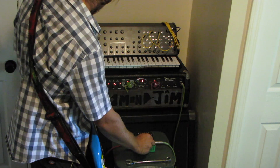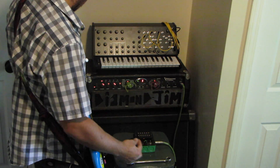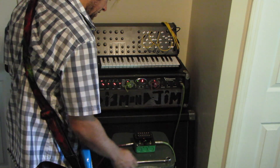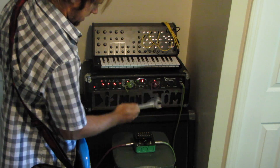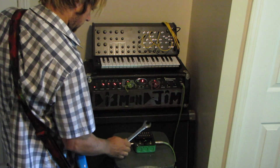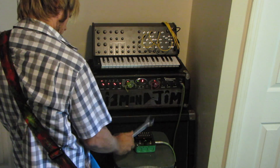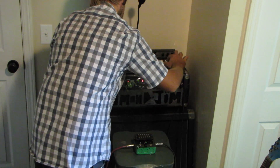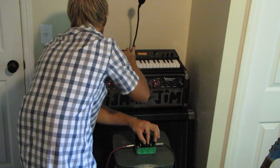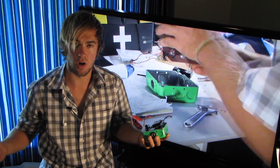With the LED mod it's going to be a nice clean drive, so go ahead and get your volume a little higher on the pedal. That gives you a little bit of nice distortion but less gain and a more clean tone. Now if you happen to have a handy wrench with a sweet magnet on it, go give yourself a little vibrato effect — it's super fun.